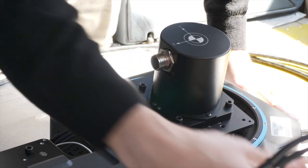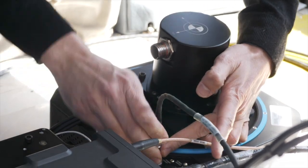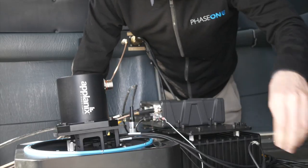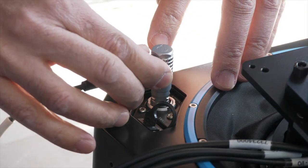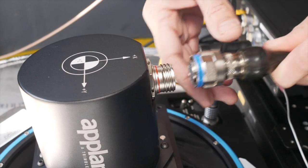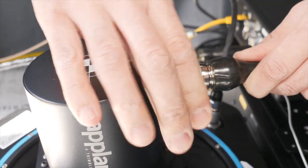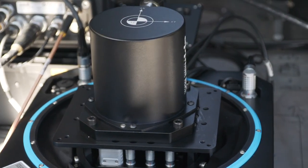The controller receives power from the aircraft and directs it to power the camera, pilot and operator displays, and the Plonix computer system. The mount has its own power cable as well as a communication cable that sends the exact movements of the mount to be recorded. The IMU, which connects to the Plonix PAWS computer system, records the positioning data and serves as a connection between the IMU and the aerial camera system's IX controller.